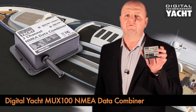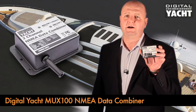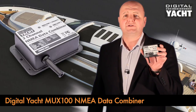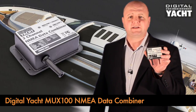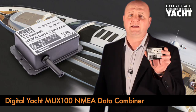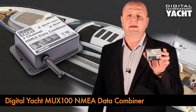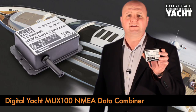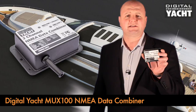Now, the MUX100 is a NMEA0183 multiplexer or data combiner. When NMEA was originally invented some 20, 25 years ago, it ran at just one speed, 4,800 baud. But with the advent of AIS systems and the additional data strings that need to be sent down an NMEA data bus, speeds have increased to 38,400 on the new NMEA0183HS standard.